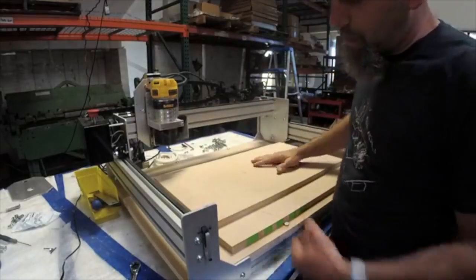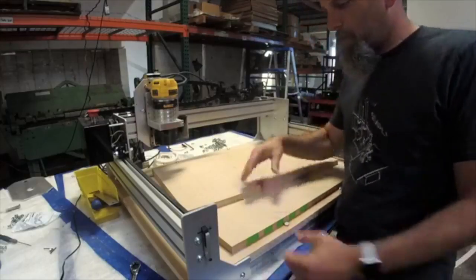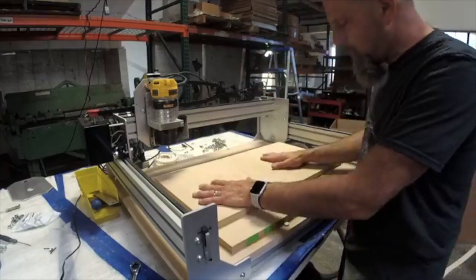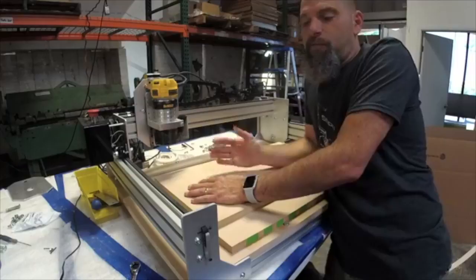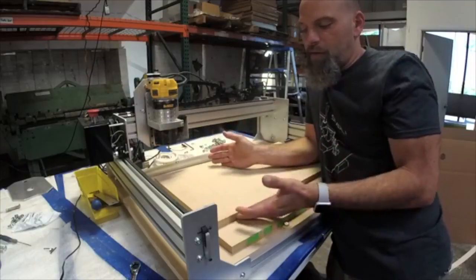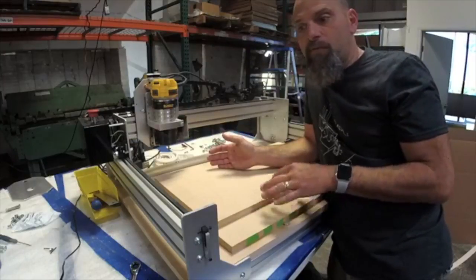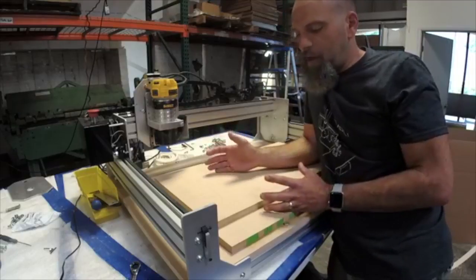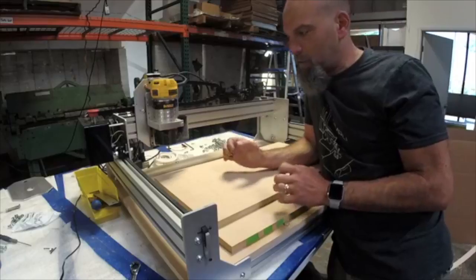This waste board does get destroyed. And you can actually fly cut it, which just means you get this expensive bit and it makes all of this completely smooth and flat so that your material can go on top. When you're done you'll get some nicks in the waste board, but the vacuum table is supposed to hold the material down. We're not getting that performance — we're using a smaller shop vac. This MDF is porous, believe it or not, and it does pull air through it. We proved it on the Crawlbot, but that was over a very large surface area. So I think we might be down to the size where who knows if this vacuum table idea is really going to work with the shop vac.